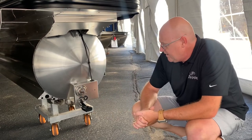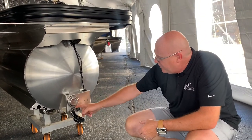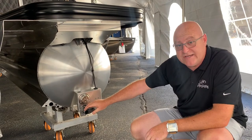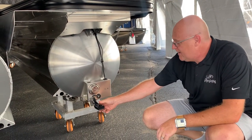So this is the transducer and bracket. Notice the wires in here are able to move around a little bit so they're not pinched. If you ever have any problems, it's probably either kicked up and giving you a false reading, so you want to make sure that this is down when you're in the running position. Very important.